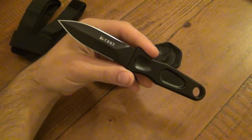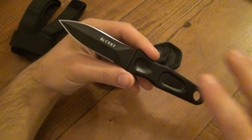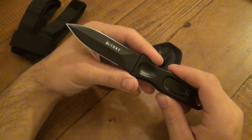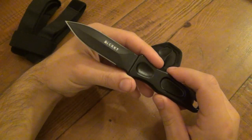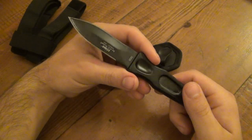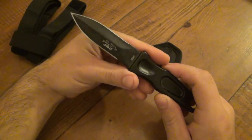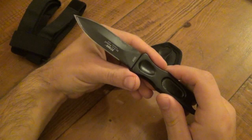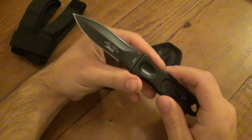If you're going to take the coating off, I would highly recommend trying to put somewhat of a mirror polish on it. The finer you polish your metal, the smaller the pores are going to be, the harder it will be to rust. So with any carbon steel, if you can get close to a mirror polish finish on this, you'll have much less problems with surface rust, and eventually real rust and pitting and all those other problems that come with that. Plus, it'd be pretty cool, but just remember, it's a shiny piece of jewelry knife, although extremely functional, just as it was before, certainly not covert.